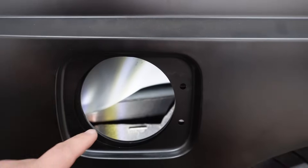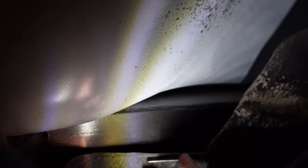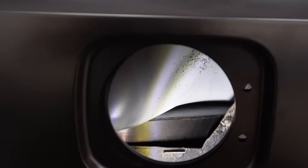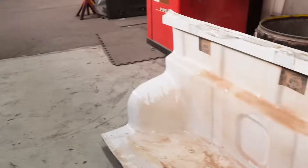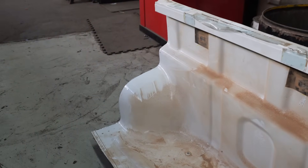I'm going to take you in the fuel hole and I'll be pointing to things and explaining it. This cut right here is the E30 — this is the one that we just made. I'm going to use this bit off of this one, cut it out, and I'll set it up so it's maybe 10mm off of the one that I made in the last episode. Then I'm just going to use sheet steel to patch up to it and back to the chassis. Let's cut this one up, get it into position, and then we can make a cardboard template of the patch panels that we need.